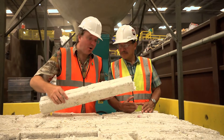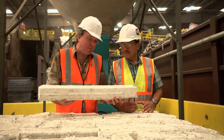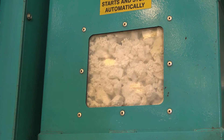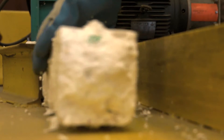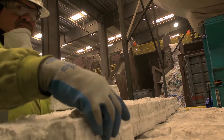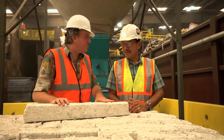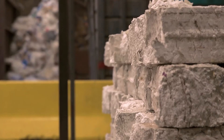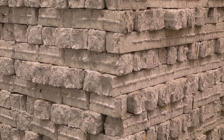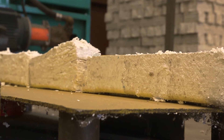So this is the densified foam. It's pretty impressive — pretty heavy when you think about how light foam is. How important is it to densify the foam here? It's very important. You want to get at least 40,000 pounds in a truckload. If it's not densified, it would be very light. If the foam wasn't densified, what would a truckload weigh? 1,000 pounds. So that's about 40 to 1. Is it densified under heat and pressure? It's only using hydraulics — just pressure.